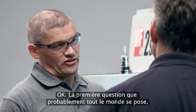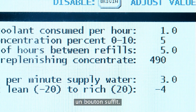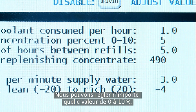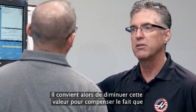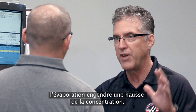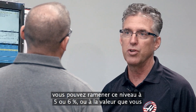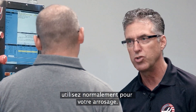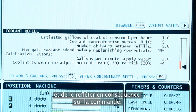The first question anyone's going to ask is how do I set up my concentration? Here you can see we have it set to 5%, and to change that it's a simple one-button click — you can change it anywhere from 0 to 10%. That's helpful because in summer with high evaporation, you'll want to lean the tank out. If you're cutting aluminum with a lot of coolant carryout, you may want to raise it back up to 5% or 6%. You can make those adjustments on the fly using your refractometer to watch the concentration change.